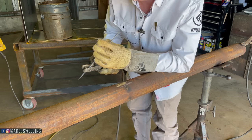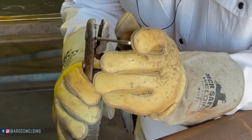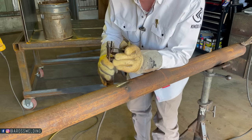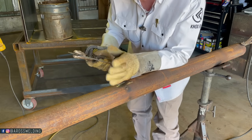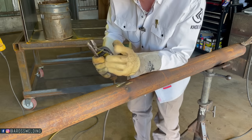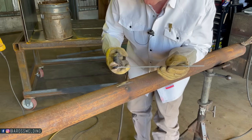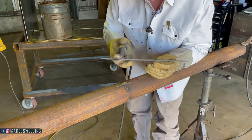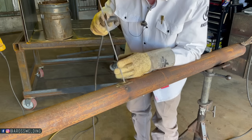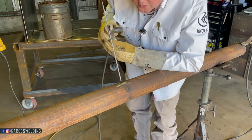By the way, sometimes there will be a welding rod where this flux covers the end of that welding rod, but ideally it's not supposed to. But if you do run into that, you just get a new welding rod or file the end of your welding rod to get that flux off the end, because the very end needs to be bare metal, because your stinger is touching bare metal here. So again, good connection, but your flux will ground it. That's why it's not arcing right now, because I'm using this as a tutorial situation.